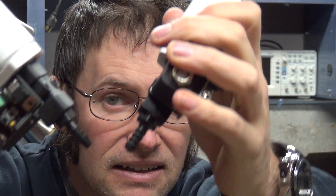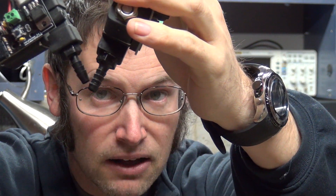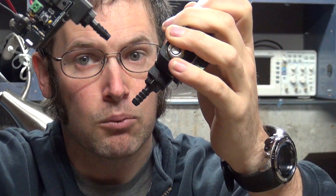I've done some experimentation — you can kind of get it working by angling two valve sensors and having them sort of at an angle, but it's not ideal and it really doesn't work for more than two droplets. What I'm going to show today would work up to four valves, because that's how many valves the Camera Axe can drive independently. However, today I'm just going to show you with two because it's easier, takes less time to set up, and it's sort of a proof of concept. I'm filming this as I go along so hopefully things go smoothly.